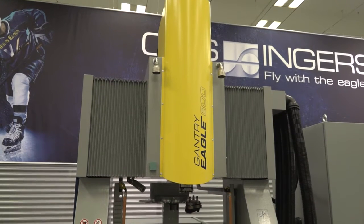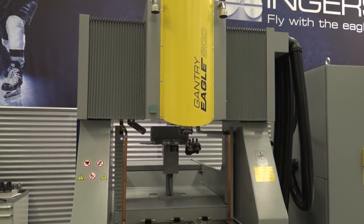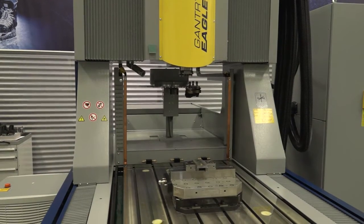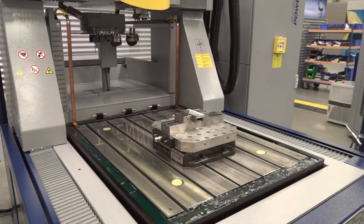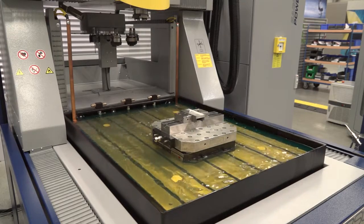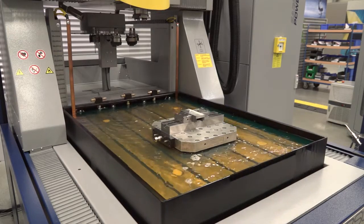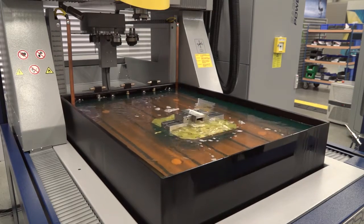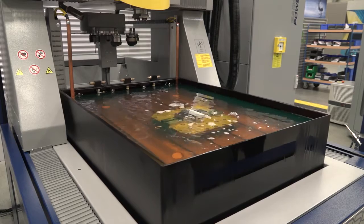In the larger machine tool, invariably you're going to be using larger electrodes. Having the large gantry design enables us to keep stability with the machine when we're moving those large electrodes around, because each machine when you're EDMing is susceptible to a hydraulic force that is incurred when moving the electrode in and out at very high velocities.